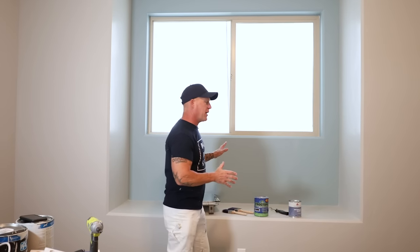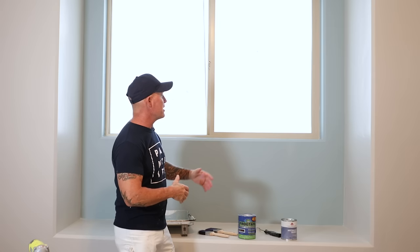I've got this big window right here, and I've already gone through the process of undercoating it. The first step in applying any of these metallic decorative coatings is to undercoat your surface first with an eggshell finish. I've undercoated it, just rolled and brushed it with eggshell, let it dry, and now I'm going to begin applying my decorative finish.